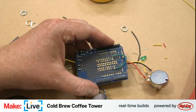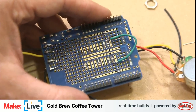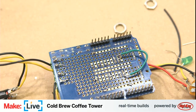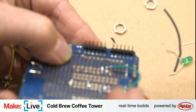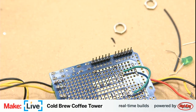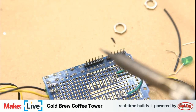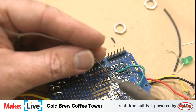Again, I immediately suspect that maybe my soldering around the diode is bad. The diode is here and here, and all these connections. I'm going to pull out this jumper. Otherwise the relay pins are here. Oh, that is not the best soldering job I see on one of these coil pins. I wonder if that's where our troubles are. It looks like it should be making a solid connection, but let's do a little bit more and make sure that connection's a little bit more solid.